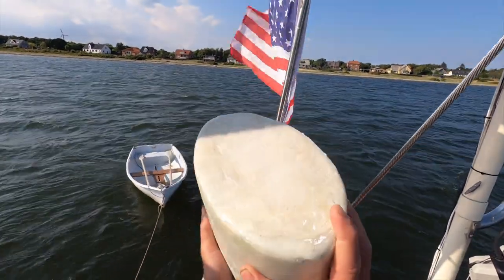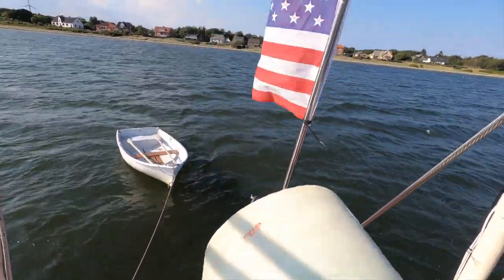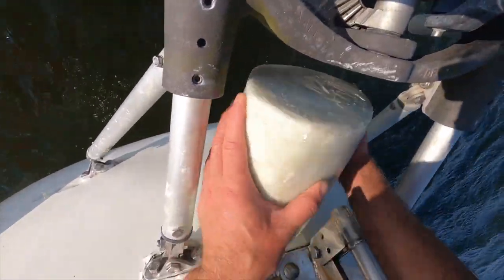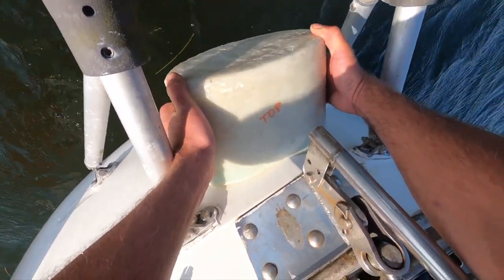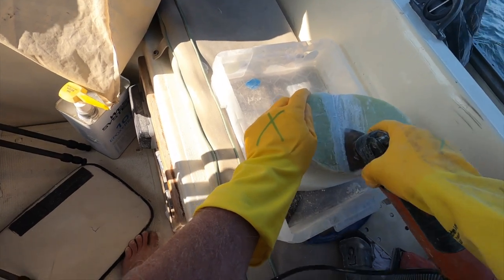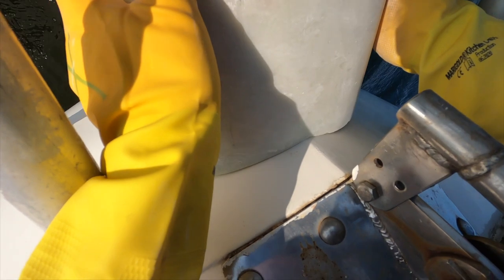Here's the brace that I made out of fiberglass. I'm not done with all the sanding I'll need to do to make it super smooth, but I'm just going to fit it on the stern to see how well it mates — and hopefully I'm not going to drop it in the water while I'm doing it. The mold that I made got a little warped out of shape before we made this brace, so I'm going to have to do some grinding to get a better fit. I think a bit more grinding is in order.